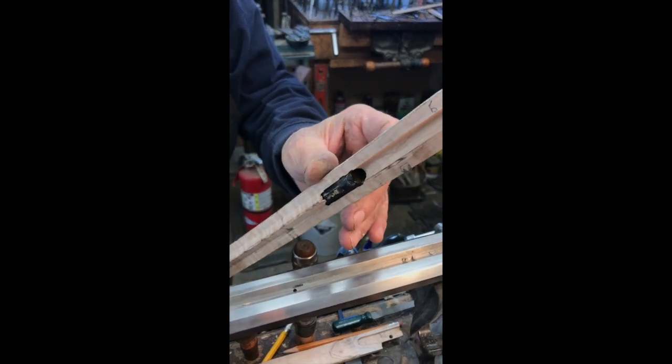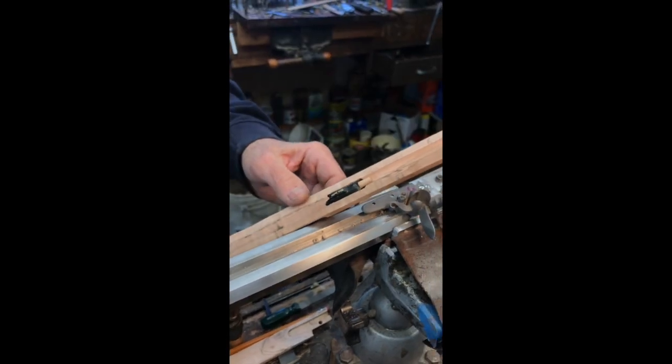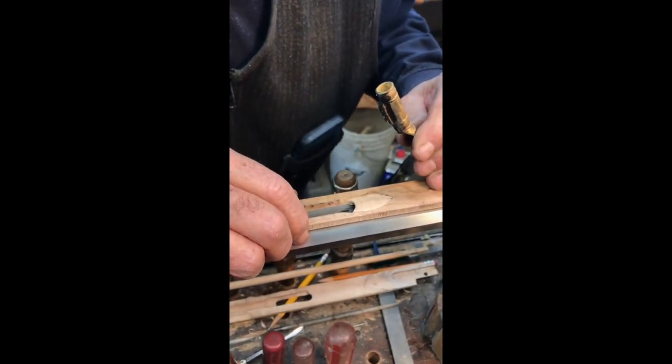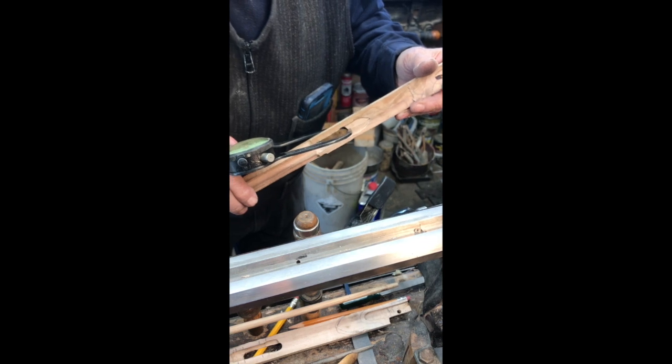So we've got to get the thimble down a little deeper so that will clear and go all the way up into here, and we don't have much thickness there. So I think we'll measure it and see exactly what we do have on that. You can see that's touching the barrel in there. Yeah, that 75 or 80 thousandths. Right there, we get 50 thousandths.